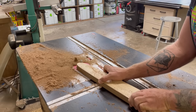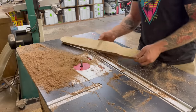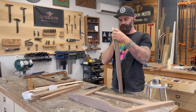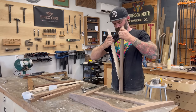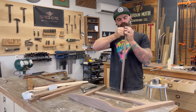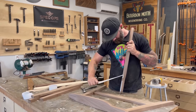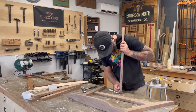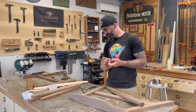Once I had my pieces cut out, I used a putty knife to get in between the template and the solid stock and pried the thing away. You want to be pretty careful because the double-sided tape I use — there's also a link in the video description — is crazy strong, and you can snap these quarter-inch templates in half if you're not careful. So just go slow and gently work the template away from your stock piece. Once the template was removed, I just peeled off the remaining double-sided tape. I'm going with double-sided tape, not double-stick — I think that's like tomato-tomato.